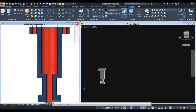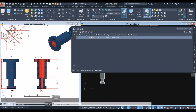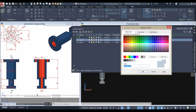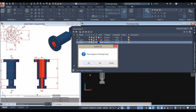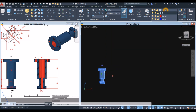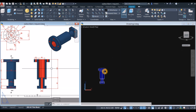To create the bore, set up layers first. Click new layer, select red for one layer and blue for the other. Change the main body to the blue layer. Make the red layer current — this is where the bore will be drawn.